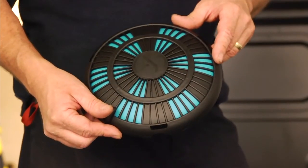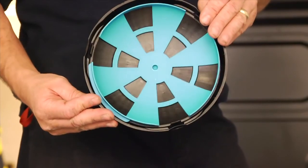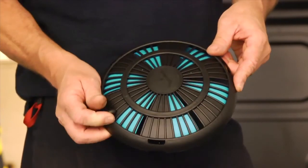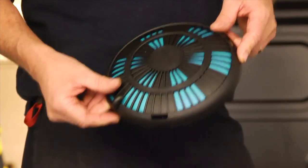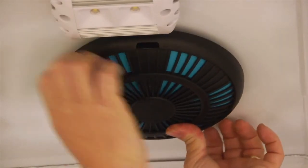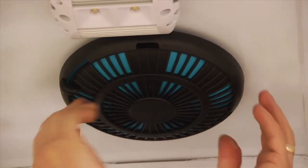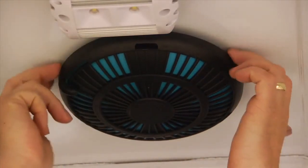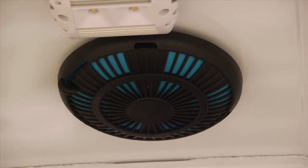All you need to do now is fit your shutter, which should always be fitted when the extraction of fumes is required. For fitting purposes, set the shutter to the closed position. Align the three clips with the three slots on the clamp plate and push firmly home, ensuring all three clips snap into place. Open the shutter to your desired position. If you have fitted the ventilator correctly, the rotor should spin freely and there should be no vertical movement.